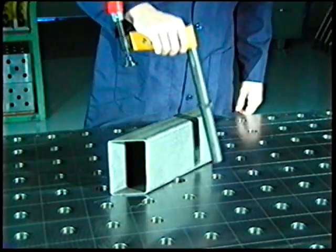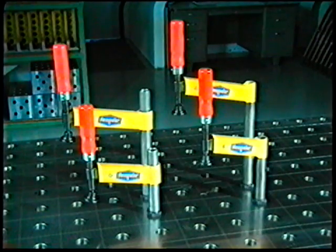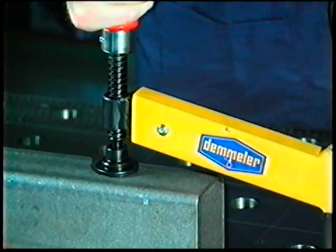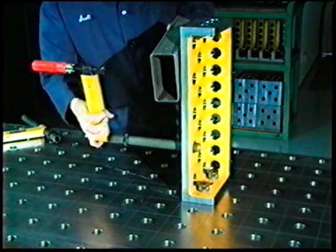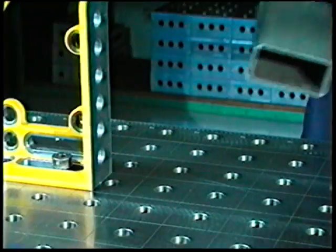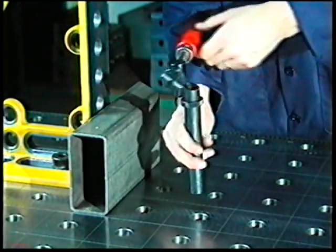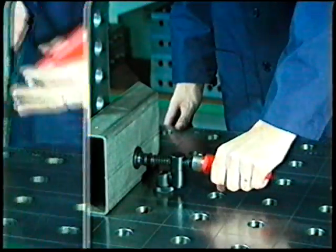The system includes a variety of clamps, which are all designed for quick use and can be engaged with a single hand. Compensating swing clamps are fast and easy to use. When the clamping handle is turned, the force causes the tube to bend back, locking it in the bore. As the tube bends backwards, a spring-loaded compensating mechanism in the arm extends, keeping the clamp lined up. The part doesn't move. Welded tube clamps are used where the area beyond the bore is clear. Adjustable tube clamps are used where there is interference beyond the bore. There are also horizontal swing clamps with a 90-degree orientation to the bore. By rotating the offset head, the reach of this clamp covers a wider range, as well as a 45-degree swing clamp.